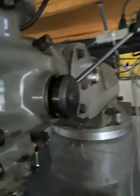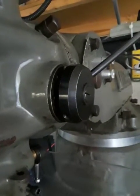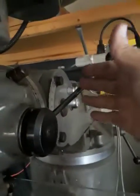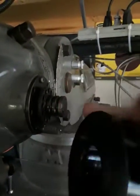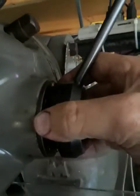This is about the quill handle retaining nut that I built. If you have a Bridgeport clone mill with this style handle for the quill, it's a nice handle, but I've always had to be careful. It's got two detents and a little ball spring in there that stops in those detents. The problem is when it's all the way in, the quill moves up and down, and you've got to pull it out to the first detent — and if you're not careful, you pull the whole handle off.